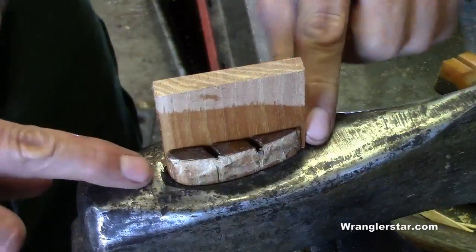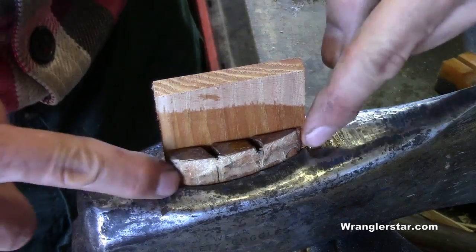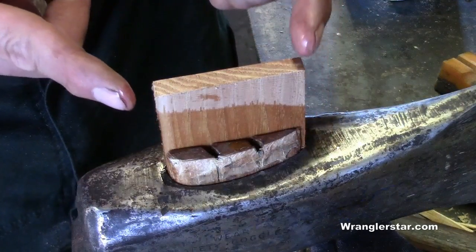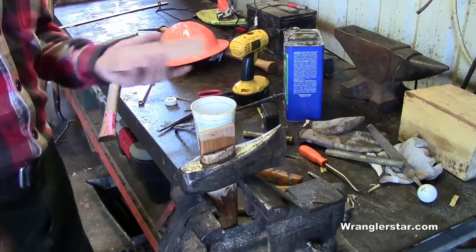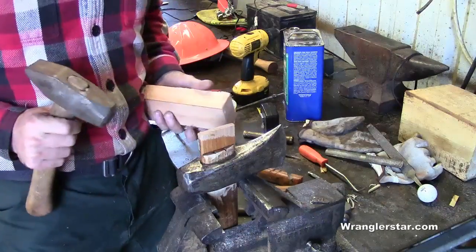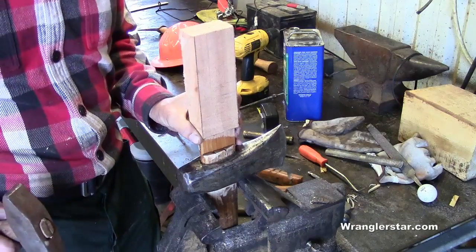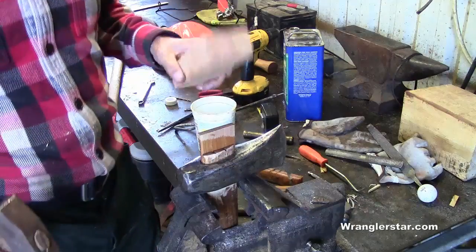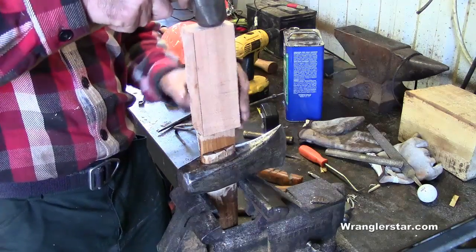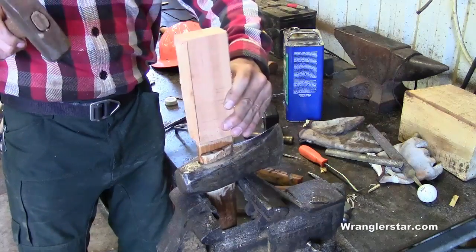When I do my wedges, I make them tight even to the outside — a hair wider than the handle itself so it really squishes — and I cut them with a little bit of a taper. Important detail when pounding wedges: if you pound on them directly with your hammer you're going to split the wedge. You want to pound on a piece of wood at least as wide as the wedge itself. And hit on the end grain, not the flat — that gives you the most force. So I'll put that on there and with really deliberate strikes knock it down.